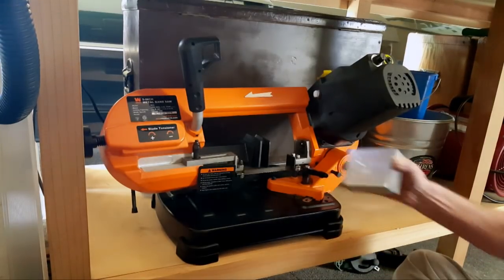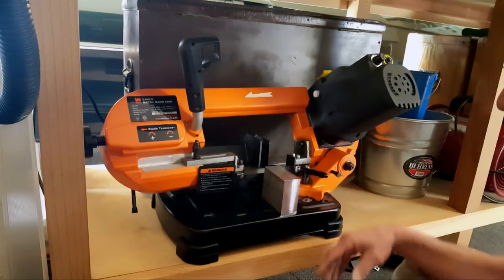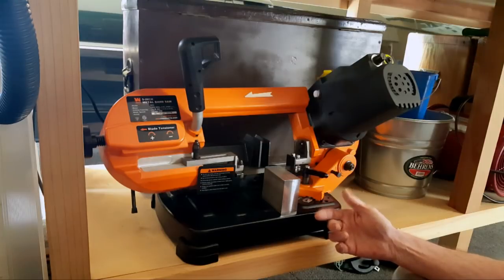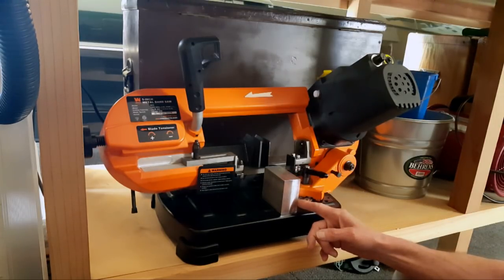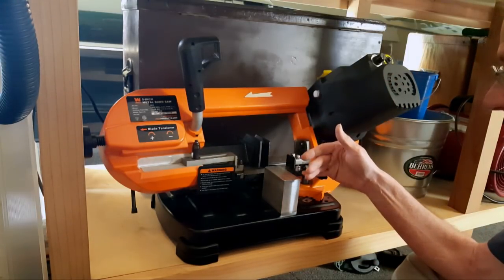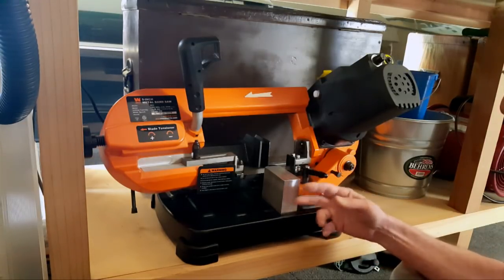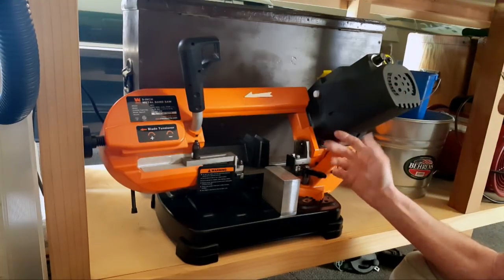I was making the top piece that goes on the top of the column that holds the constant force pistons. So it's pretty big. That's 3 inches by 1.5 inches. It's in the vise. I've got it marked. I'm cutting it to approximate size. I'll get it to actual size on the mill. It's cutting away, having a good time here.